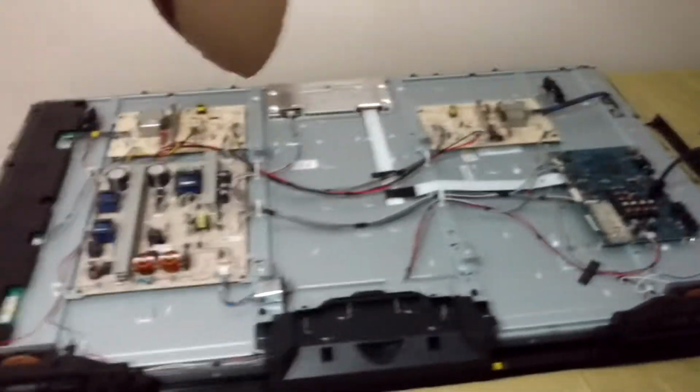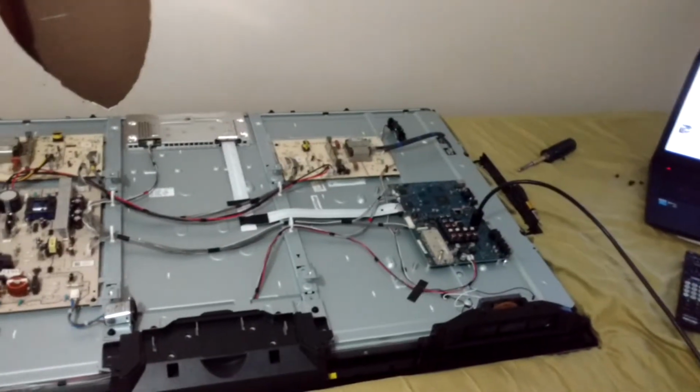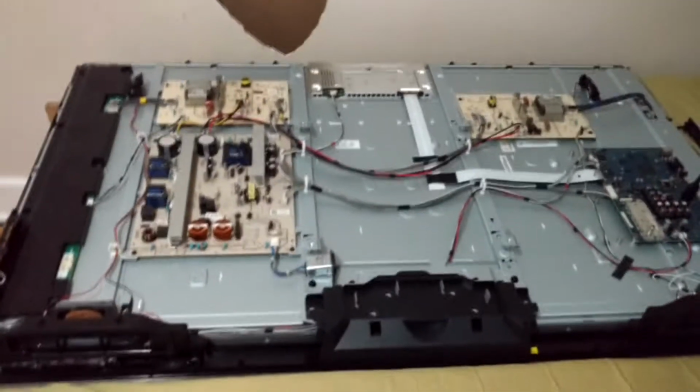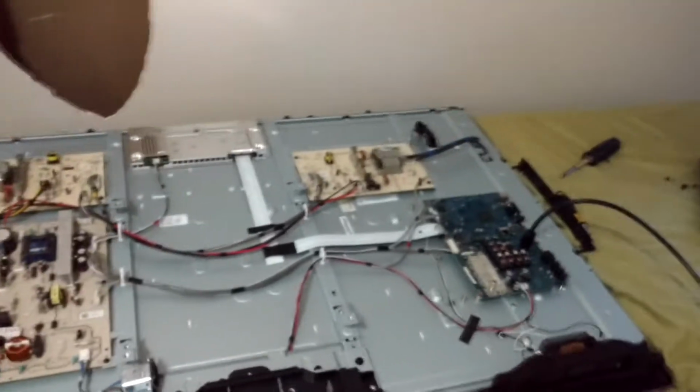Yeah, just put a fan on the heatsink. That might be all it is. So I'm gonna maybe let it cook under the air a little bit longer, and put that heatsink back on and mount a fan onto it. There's 24 volt and other rails. I'm sure I can find 5 or 12 volts somewhere in this thing, easy for a fan. And we'll see if it works.